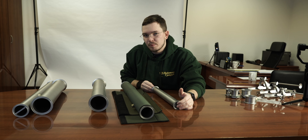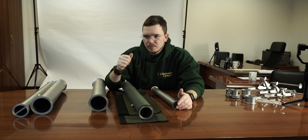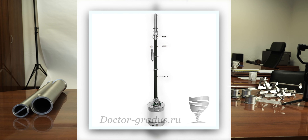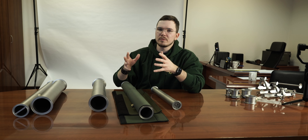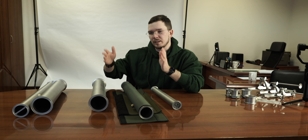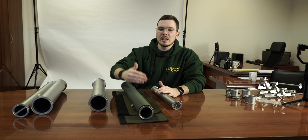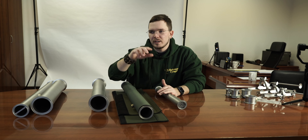We can calculate the needed amount of SPP if you want to build a liquid management distiller that should give you about 2.1 or 2.2 liters of neutral spirit per hour — for example, like our Cosmo Pro. This is an excellent distiller; you're able to collect a lot of high-proof alcohol during the second distillation, around 2.2 liters per hour after cutting heads and collecting hearts. If you want to build something like this and order packing and extensions from us, we can suggest the needed amount calculated and tell you the cost.